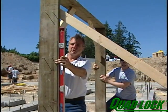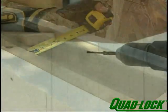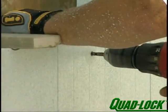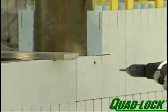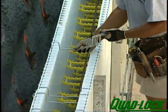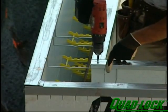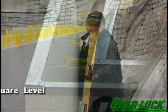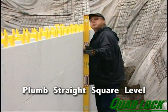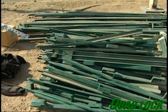Also check: window and door openings are square, braced horizontally and vertically, with slots and sills accessible and 1x4s or windlocks fastened securely around the perimeter. Wire-top ties at each end of top units and at 24 inches. Metal track secured on top of wire-top ties and wall. Walls must be plumb, straight, square, and level. Ensure extra bracing material is on site and handy.